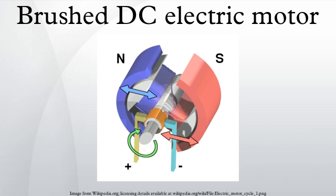The effective voltage can be varied by inserting a series resistor or by an electronically controlled switching device made of thyristors, transistors, or, formerly, mercury arc rectifiers. Series parallel control was the standard method of controlling railway traction motors before the advent of power electronics.